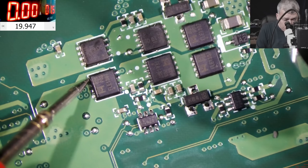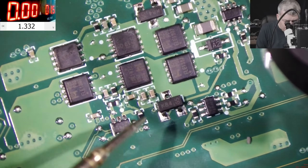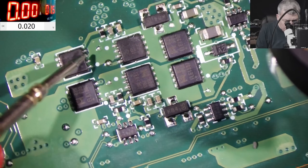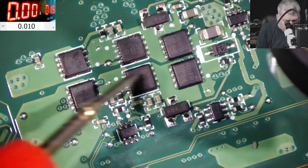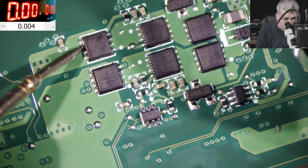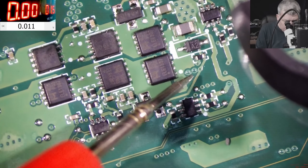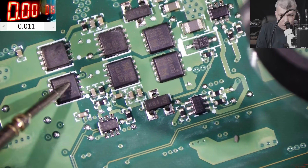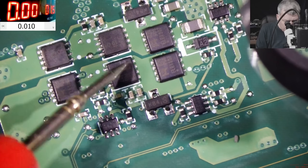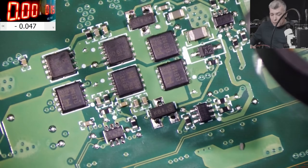Here is the input and then you have pairs of MOSFETs and here is the output. You have pairs because you have two USB-Cs - one chain is for one USB-C and the other chain is for the other USB-C. On the port I plugged in now we have input at 19V; on the other one there's no input because I can swap the charger. You have input MOSFETs, two MOSFETs, then a separation MOSFET to prevent voltage going the other way, and then your main power rail.